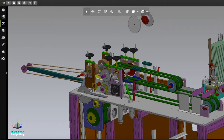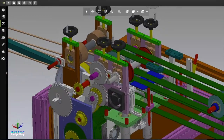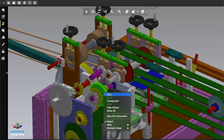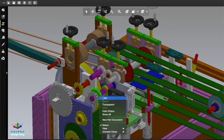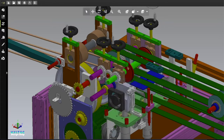Here you can see two ultrasonic rollers - here in one piece and here is another piece - and here are two ultrasonics attached. Let me hide the table so you can see inside. Zooming in a bit, you can see there are two pinions - the synchronized pinions are attached here - and all are synchronized and connected very well. Once one pinion moves, everything just moves. This is the main axle of the ultrasonic sealing roller.